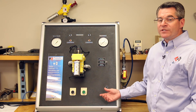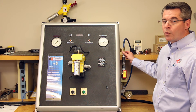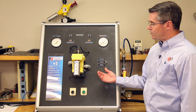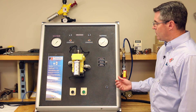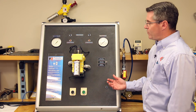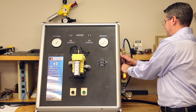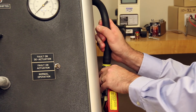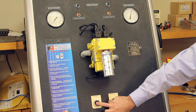This is something we see very commonly in the field. If quick disconnects are used that are too small, or elbows, fittings, or undersized FRLs, the valve will be starved when we go into this condition where we've dropped the air while it's energized. If the valve will not reset and every other condition is met, typically it's an air supply issue. By removing this undersized line and supplying it with a full supply, the valve will reset properly.